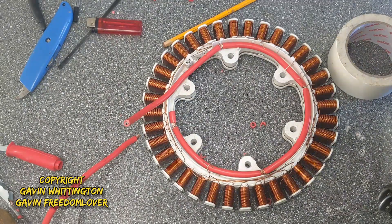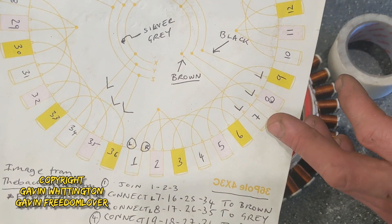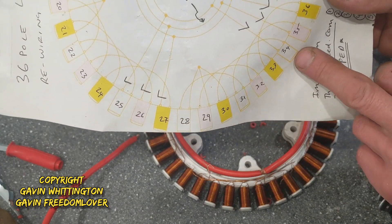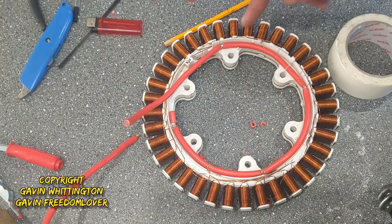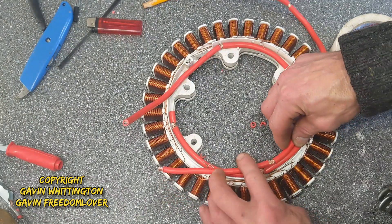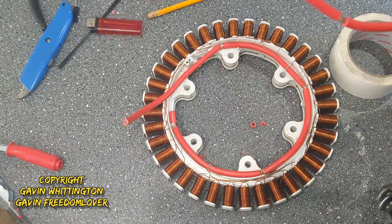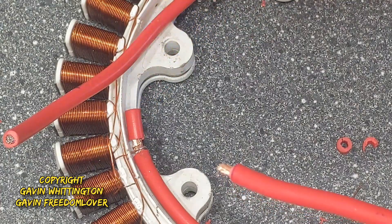So that's how that looks. Referring back to the diagram again — what we've done is we've connected 7, 16, 25, and 34, which makes the first phase. See, there are four places it's connecting: one, two, three, four. When we do the second one it will be a little bit staggered, like that. We obviously have to make sure nothing is touching that we don't want touching. This may get a little bit more difficult because of the thickness of this cable and the amount of wire I've got left to bring over, but we shall see.